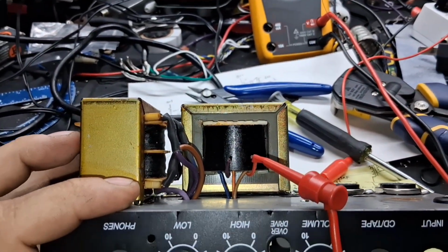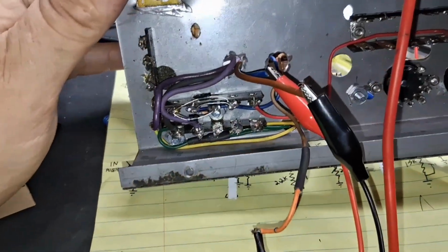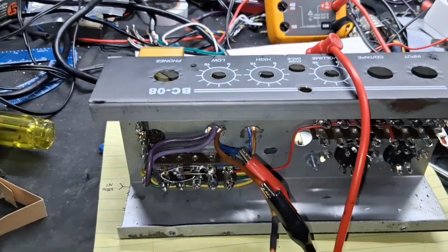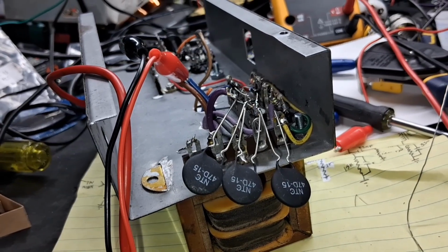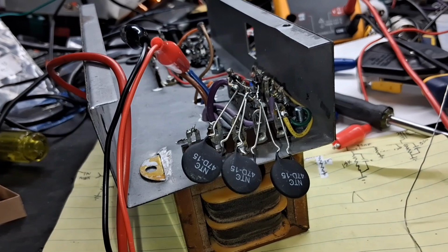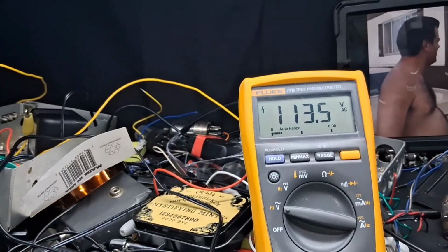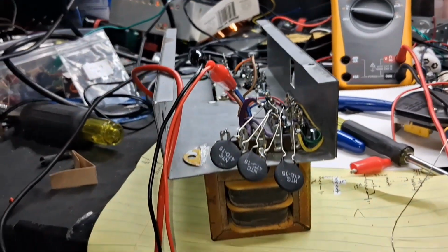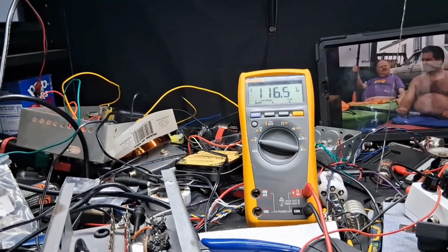That's because it's getting too much voltage into its primary coil, and it's not really able to keep running like that. With 3 of these NTC thermistors in series with the secondary coil of the second power transformer, at 113 volts, it's climbing a little bit as the resistors heat up, but it's not 170 anymore. That might possibly keep the transformer from melting itself.